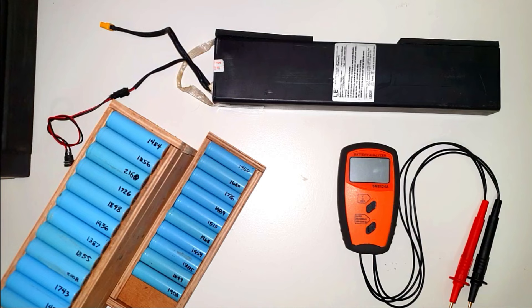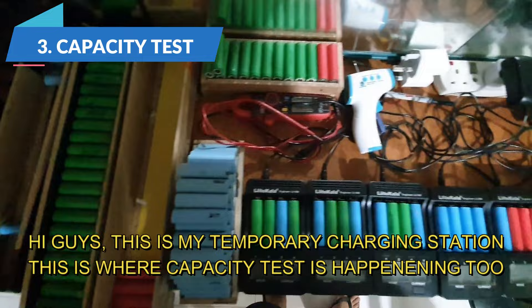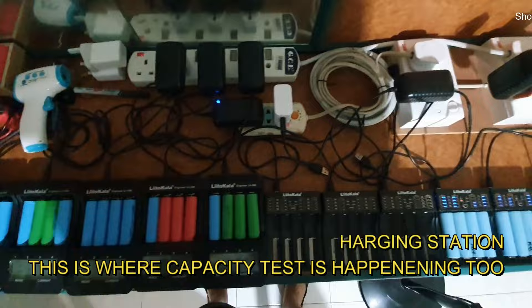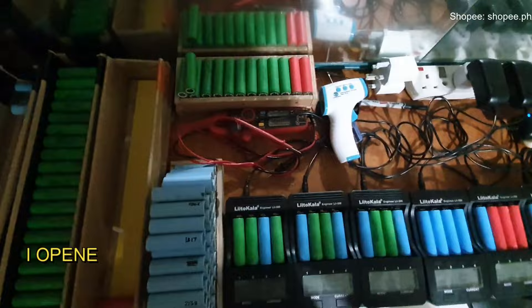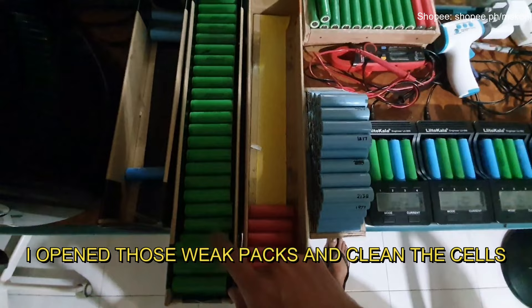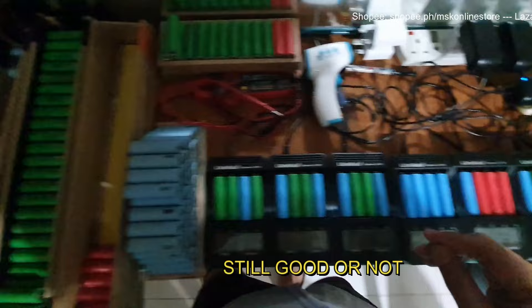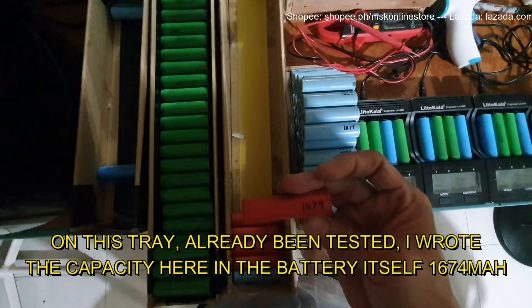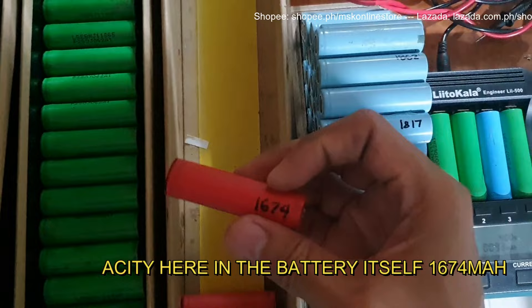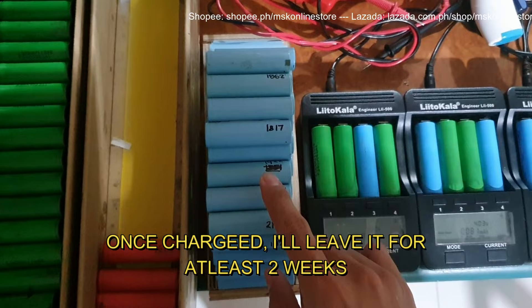Next is the cleaning, grinding, and preparation of our 18650 cells — I also have a video for that. Now, the capacity test segment: this is my temporary charging station and temporary station for capacity testing. These cells came from old electric scooters with worn-out battery packs. I open them, remove the cells, take off the nickel plates, clean them, and then check if the capacity is still okay. This layer here hasn't been capacity tested yet, but this one already has a reading written on it — 1,674 mAh.